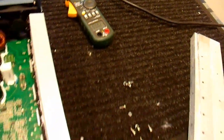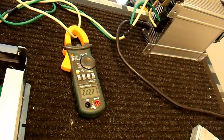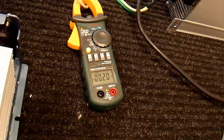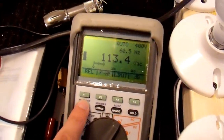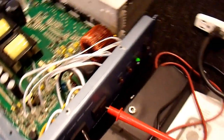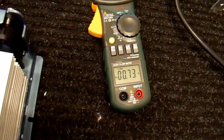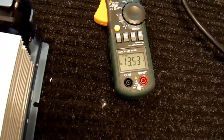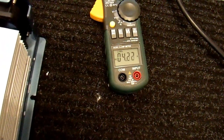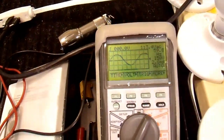No current so far — that's good. Let's see what happens when I turn the power switch on. It seems pretty normal, and I have 113 volts AC out. Seems like this thing might actually work — it's a nice clean sine wave on the test leads. Let's see what happens when I turn on a 40 watt light bulb. Watching my current — 4 amps. That is about what it should be, and I still have a nice clean sine wave.